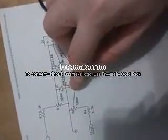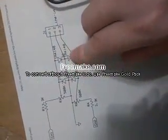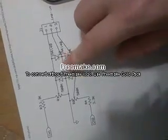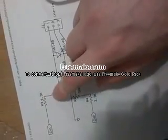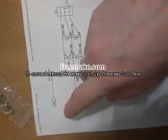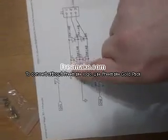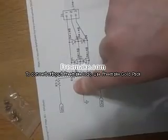These diodes here have a voltage drop. The idea of using four of them like this is so that if we have it trimmed up here, which divides it by the voltage of channel one, and let's say channel one had like 10 volts and we got 5 coming out of it, we can't have that going into the sound card because it'll break it.